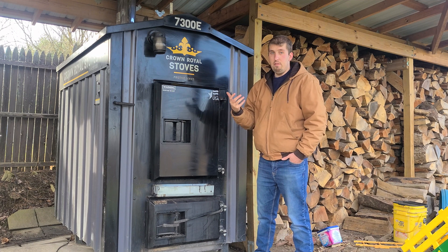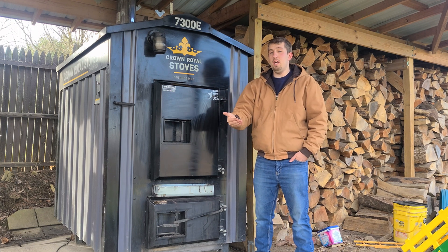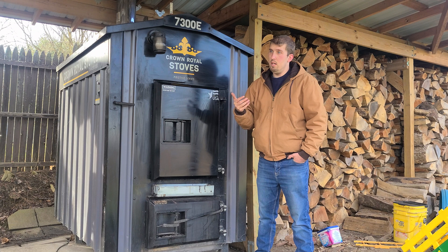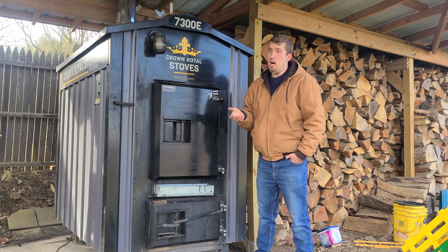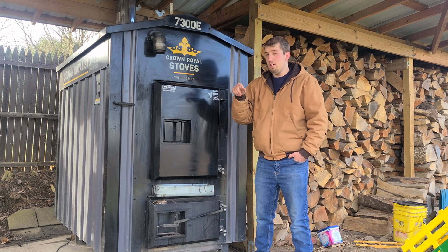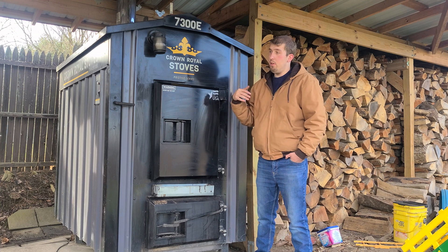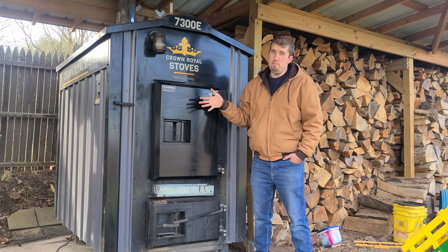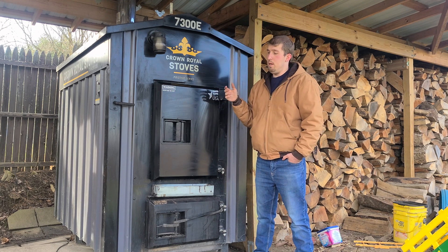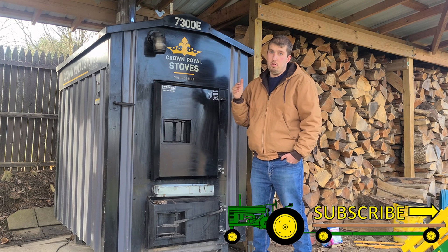So I have indicators set up that if it runs for too long — and how I do that is it's reading the energy usage — I can say that if it's running 540 watts for more than 15 minutes, it alerts me on my phone. I know based on the history that 540 watts is the combination of everything running on this breaker: I've got the water pump and the wood burner pretty much, and a couple lights. Based on that, I have it notify me. As soon as it's past my limit, I know there's an issue.